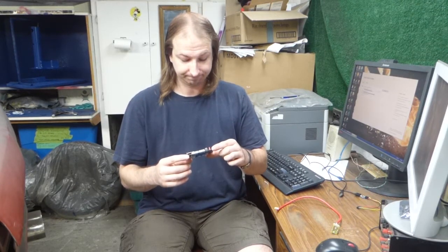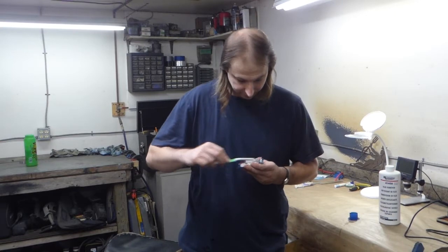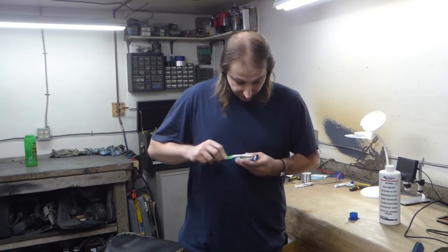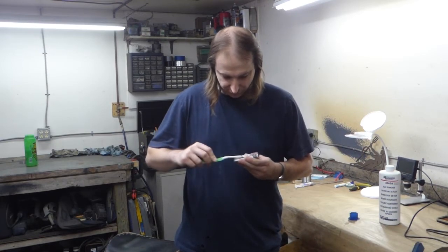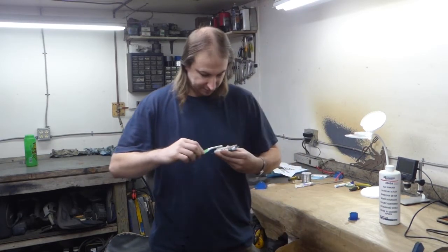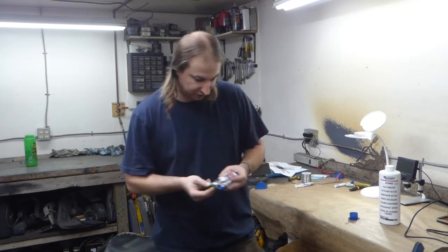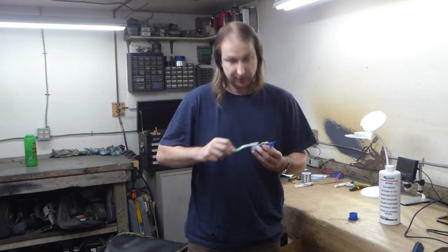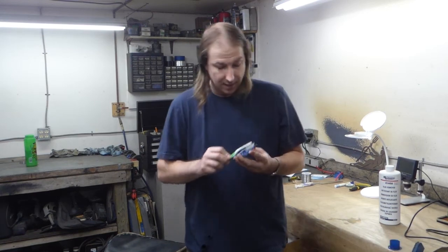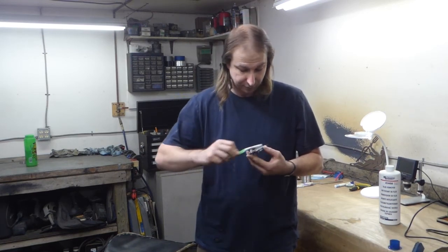So, now I just have to make 2 more. However, before I build the other boards off camera, just gonna clean all of the solder flux off of this one because I don't like leaving that flux on there for too long. It actually absorbs water, can start corrosion, ends up getting under the pins of the chips and just generally can make a mess. So a little bit of flux remover to, well, I don't know, remove the flux. And I'll build the other boards off camera because it's just going to be a production line of 2 more.